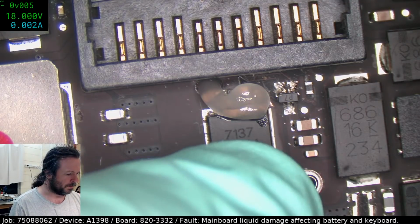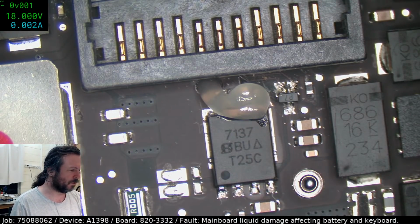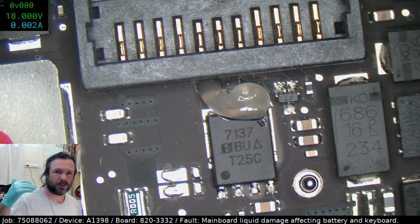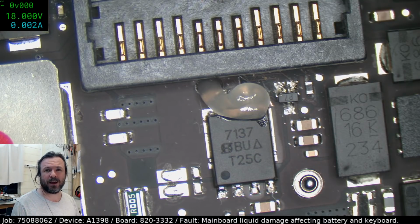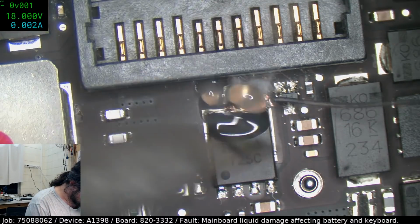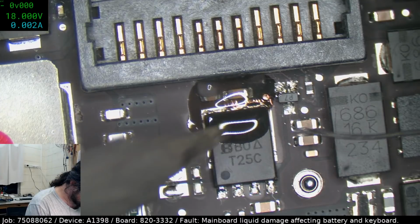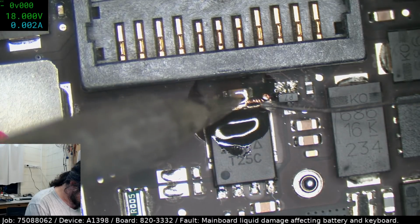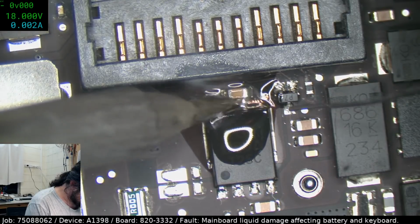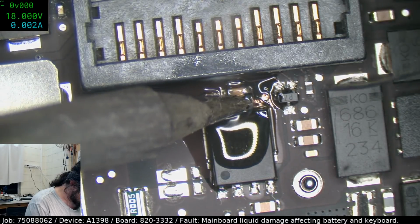I'd imagine it would be warm, but not extremely hot. It's probably only because the voltage delta between the battery pack and the other side of the MOSFET would probably only be maybe half a volt. So maybe you've got 500 milliwatts coming off the MOSFET, but with the amount of flood planing around it, you really won't feel 500 milliwatts. It just won't be felt at all.